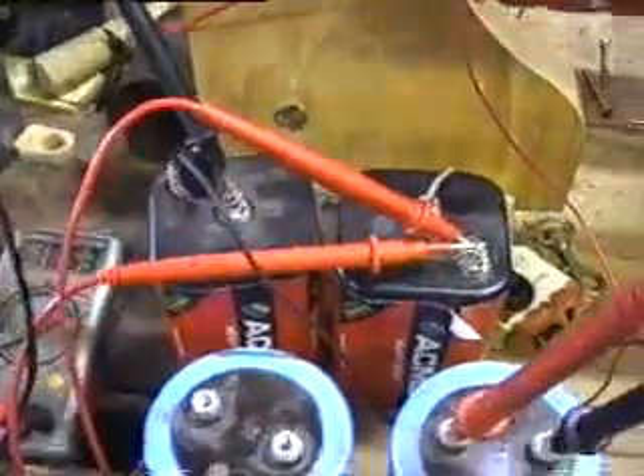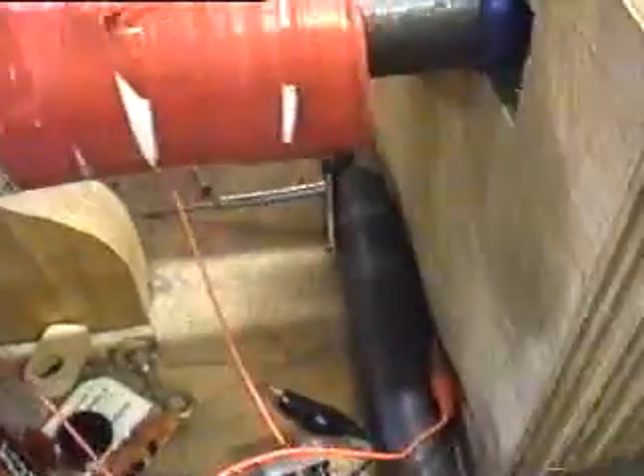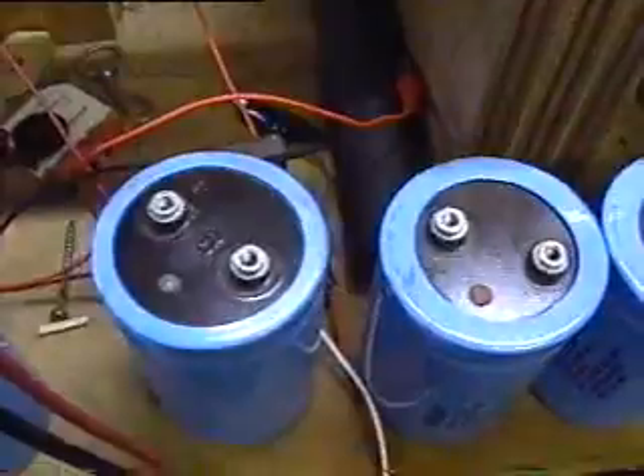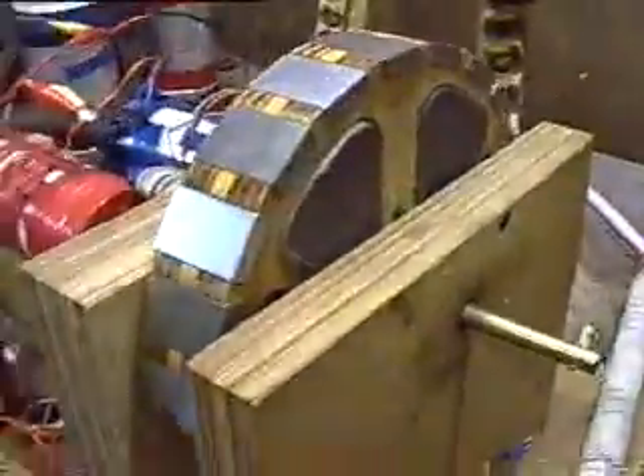It's still at 28 volts on that one. This one — 26 volts. So they're all charged up above the battery voltage. I wanted to explain also that the input from the batteries going through the commutator to the coils is also connected directly to the capacitors. So the input charges up the capacitors to the voltage of the batteries, and the collapsing current from the coils charges up the capacitors to over the battery voltage.